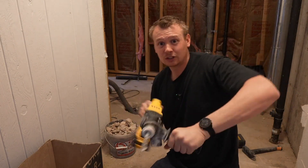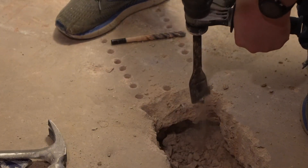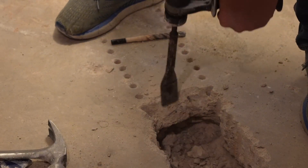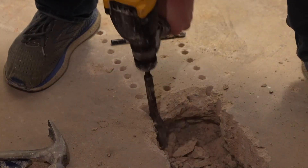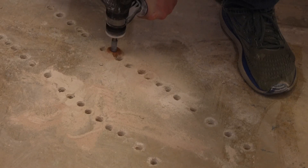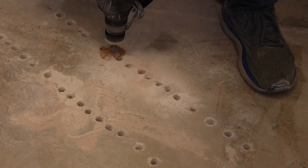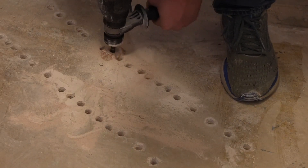It's a pretty basic tool. You can use all sorts of batteries on it — like a normal 20-volt battery will run it, but it runs out of battery pretty quick. With one of these 60-volt max batteries, I can do about 50 or so holes into the concrete. A hole only takes about 15 seconds or so to drill, and then I've been chipping out with the other bit.